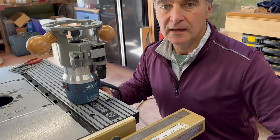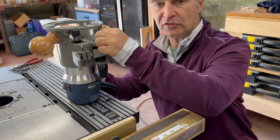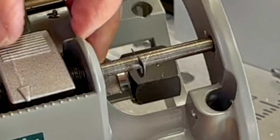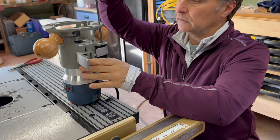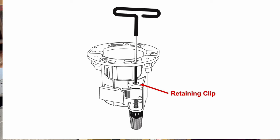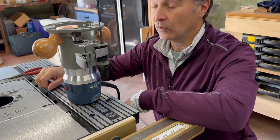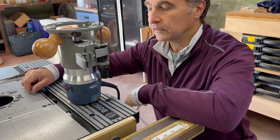So I think I found the problem. What is happening here is just this retaining clip or slip ring that mounts on this adjusting shaft. For some reason that doesn't want to stay in place — maybe I forced it a little too hard and it slipped out. But I was able to pull it down in place and now it appears that the lifting mechanism is working as advertised. However, it's really not on there very tightly. I tried using some needle nose pliers to tighten it, but that doesn't seem to have much of an effect. There's really not much of a slot cut in the shaft for this retaining clip to stay in place, so I'm not sure how long it's going to last.